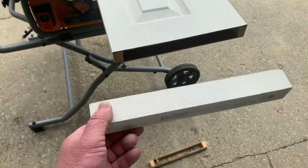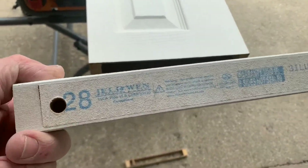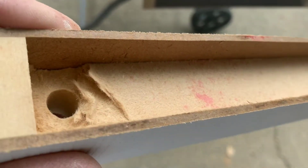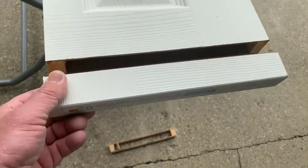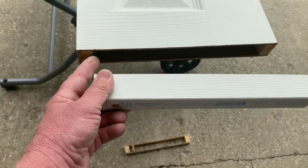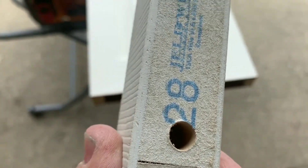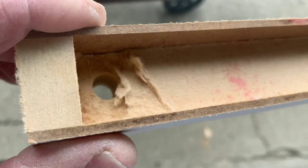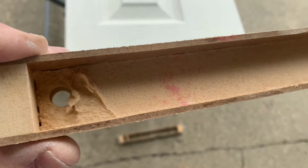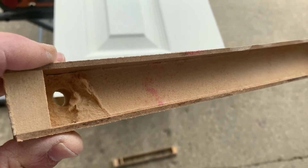The block has been removed. In the old days, when doors had more integrity, I would actually peel off this veneer laminate and reuse the same block. But because it's just glorified cardboard now, I don't like to do that. I'm going to show you how to cut new blocks using two-by lumber — I have a two-by-two. I'll cut and put real lumber back in here that has much more strength and grabbing power than this glorified MDF. I just like to use real wood — call me a dinosaur.